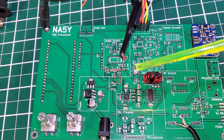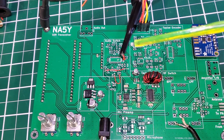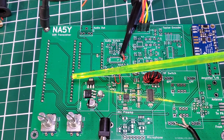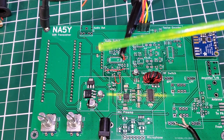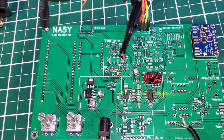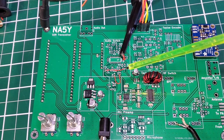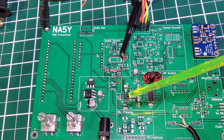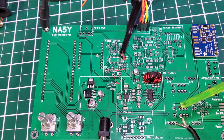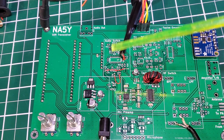The good news is the nastiness I was seeing in the last circuit appears to have completely gone away. I'll leave you all to theorize why — there are just so many variables. My main suspicion is the way the ESP32A1S was hooked up on the last board was contributing to that. This is good progress. Next video I'll make sure that when I put the audio switch in it still continues to work, and I'll put the RF switch in and build it back to where we were in the last series of videos with the malfunctioning receiver.